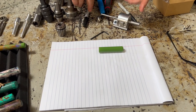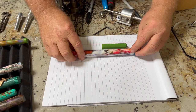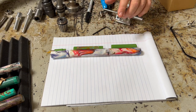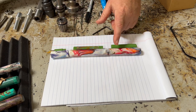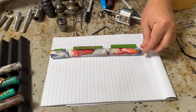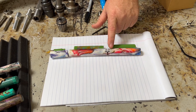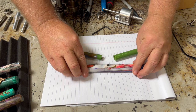Let's start off with the cap. I'll give you some approximate sizes of blanks. I've cut my blank to length — I've got my cap, my body, and my section, which we're going to do in the next video. You're probably wondering why these are a little long. One reason is I'm using a bespoke pen blank, which are typically eight and a half inches, and I went ahead and made my three cuts. I left it a little long because we're going to use some of that for holding, for shaping, and for trimming — and it's just nice to have a little forgiveness. I've marked two lines so I know where my cap and body should meet, so if I have a color pattern I want to keep through the blank I can try to do that.